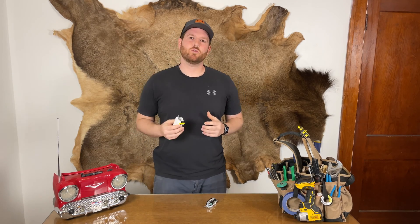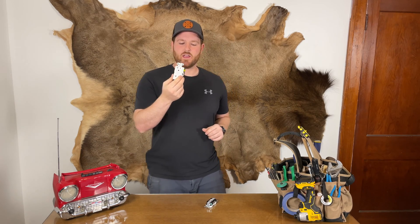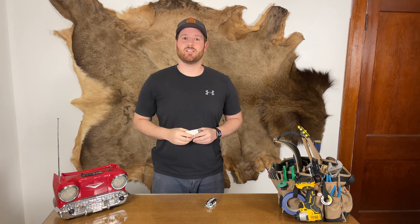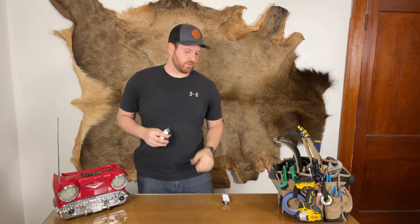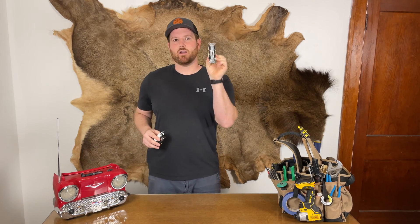Quick story time. Most of my houses that I work on are really old and have really short wires to work with. I was installing a GFCI outlet that's designed to be backwired, and it saved me a ton of time and headache — no more J-hooks. So I researched and found that if you upgrade to a commercial outlet, it too offers the backwiring capabilities.